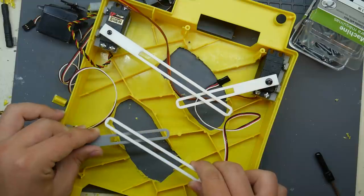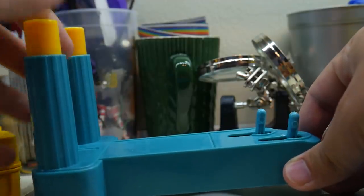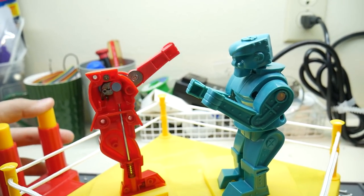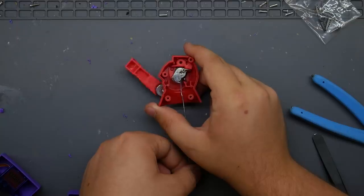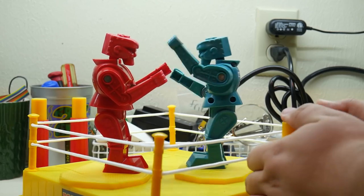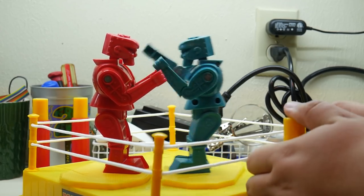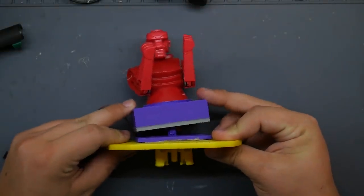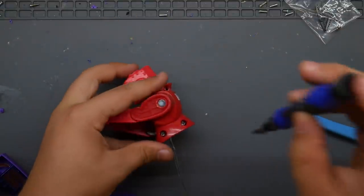I would use a Raspberry Pi 4 and an Adafruit servo hat to control the servos and interpret Joy-Con commands. Each robot is originally controlled by a plastic controller with two buttons that push a metal rod up and down to move the arms. The arms require very little force to move, so one micro servo is strong enough. The controller can also be moved forward, backward, and side to side to move the robot in the X and Y axis. I replaced the metal rods with thick paper clips so they could easily be moved by a servo.